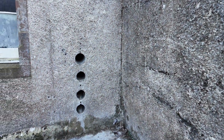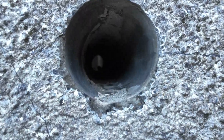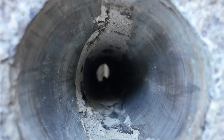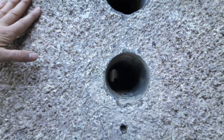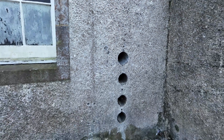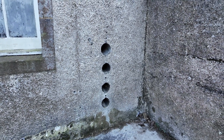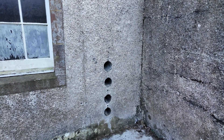This is where we're going to take the pipe work into the castle. If you look through that hole, we have got 1.2 metres of wall thickness. What we did was we hired a core drill which we bolt to the wall — it's an automatic feed core drill with a little motor on it, and it sits there and drills itself. We've got to get from the plant room, which is over here, all the way across into the actual castle itself.